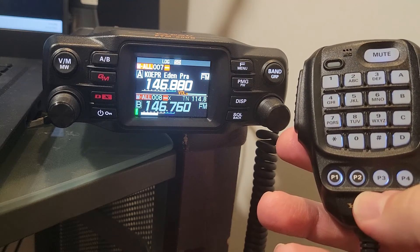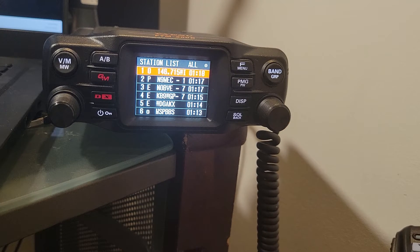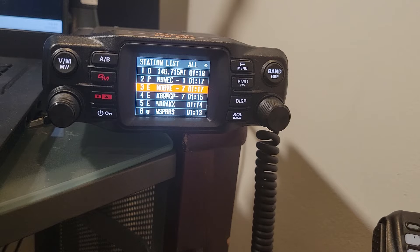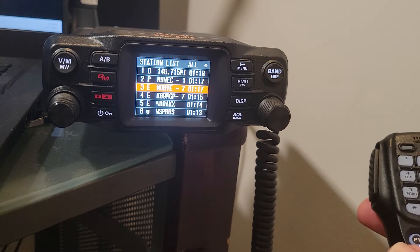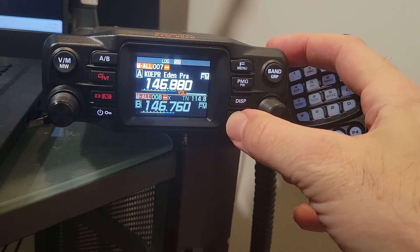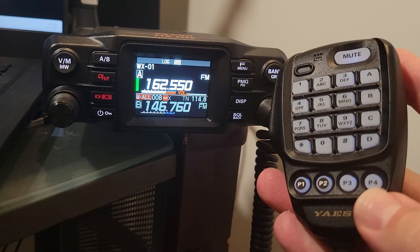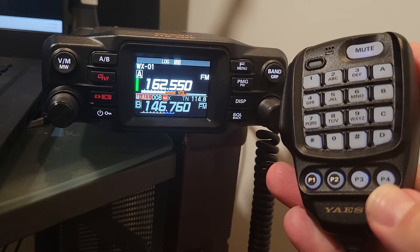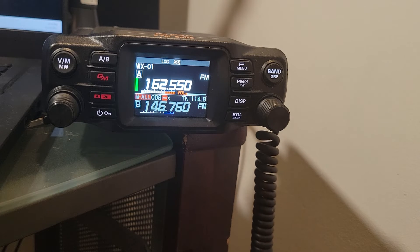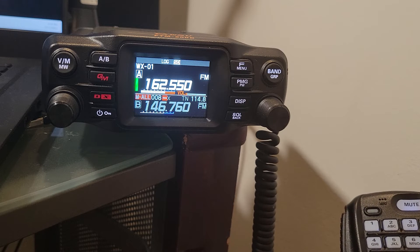I have been playing around with APRS, so I've used my P3 button to allow me to go into the log list. I can cycle through the various beacons that have come in or messages that have come in and take a look at them. And then P4 automatically takes you to the frequency that transmits the weather, so you can just pop that button and listen to the pre-programmed weather for today.